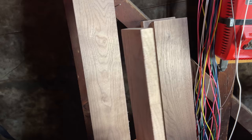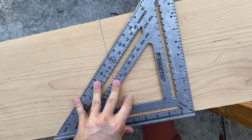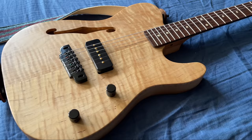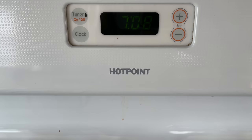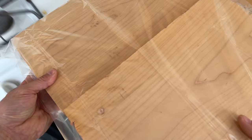I have some walnut that I was going to use for this, but I'm not sure I want that dark of a color, and it's too thick — I'd need a planer, and I don't really want to buy one. I do have some maple that's about the right size. It's a little lighter than I'd like, but — roasted maple! I did this on my guitar that I built and never learned how to play. I got some maple and roasted it in my oven to give it a slightly darker caramel color. Back then I had an oven with a fan and a pretty consistent temperature. Now I rent a house, which means I have the cheapest possible appliances — a genuine Hotpoint. Seems like Hotpoint is not a great name for an oven; it implies that one part will be hotter than the others. I wrapped the maple in some oven bags to keep the house from smelling like roasted maple. It did not work — it kind of smells like someone drizzled maple syrup on freshly baked cookies and then set them on fire.